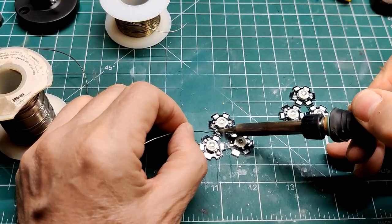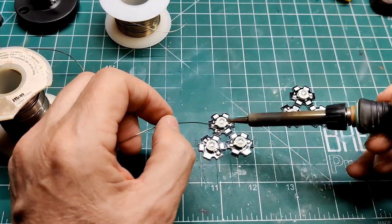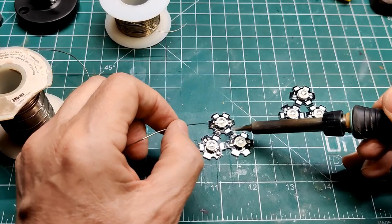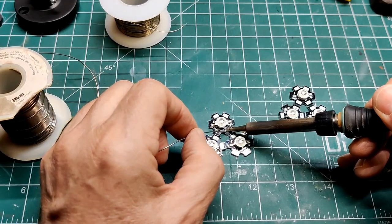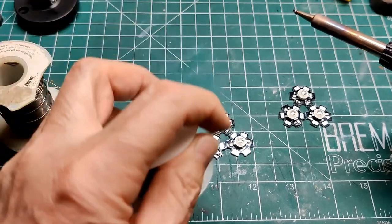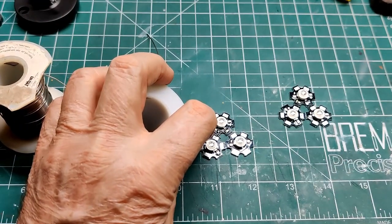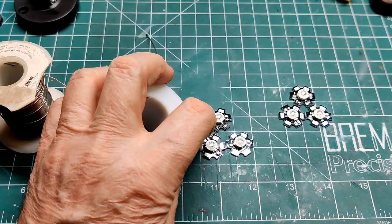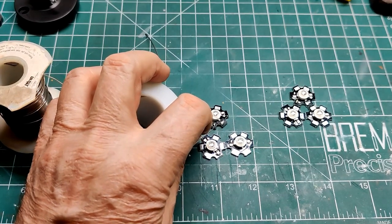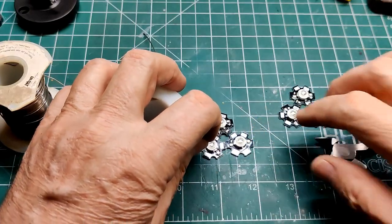I started off with making the UV LED triangles. Since I'm using 12 volts I was able to wire the LEDs in series. The LEDs have a range of 3.2 to 3.4 volts, however they get very hot above 3.2. I settled on about 3.1 volts which gave me a reasonable amount of UV light without an extreme amount of heat to dissipate. To make the connection between the LEDs I'm soldering some uninsulated bus wire between each one.